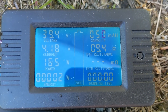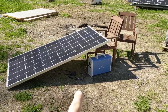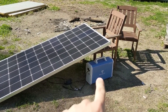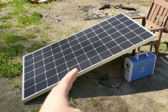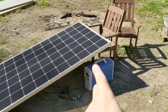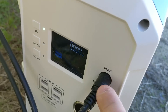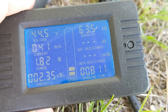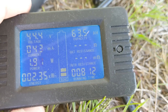Now different MPPT chargers can do this faster than others, and it says we're charging it at 173 watts. And on this meter it says 165 watts. It's the end of the day and we are done charging the portable power station. Now this is the 240, so it's supposed to have a 2.4 kilowatt hour battery pack in it. The solar panel is currently facing southwest — I've been moving it throughout the day. This says zero on it so it's not taking in anything else from the solar panels, so it must be full. And this says 2.35 kilowatt hours over the last 8 hours of run time. So that's awesome.